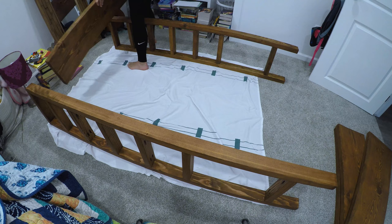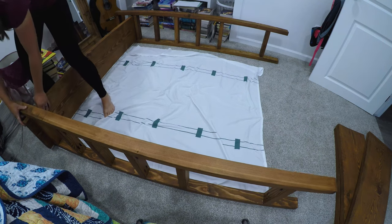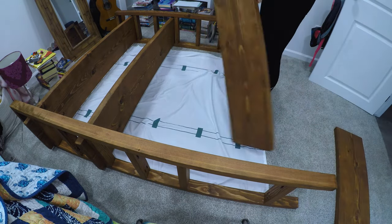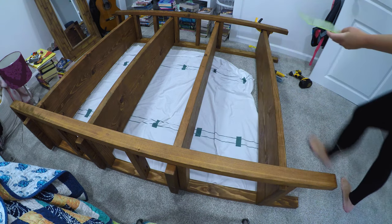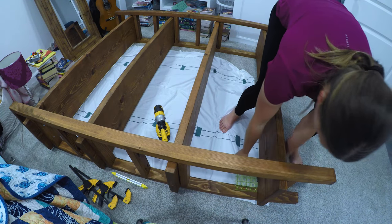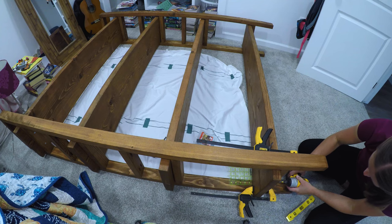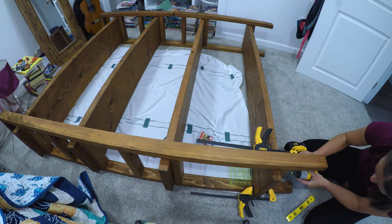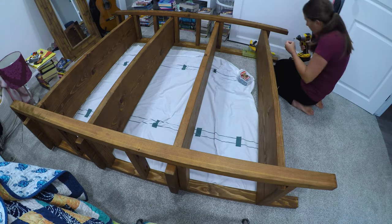Now that the legs are built, it's time to assemble. I recommend moving the wood parts to the desired location first so you're not moving a heavy finished bookshelf. I placed the legs on a flat surface with the 3-inch side facing up, then placed the shelves onto the legs. I used an 1/8-inch thick ruler to place an 1/8-inch space between the shelf and the leg piece, and adjusted for a 1.5-inch overhang. I clamped the shelf to the side piece and secured it through the pre-drilled holes with 2-inch screws, using a 90-degree drill attachment where needed.